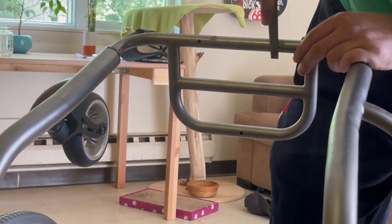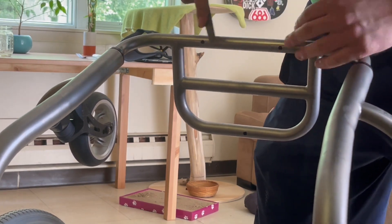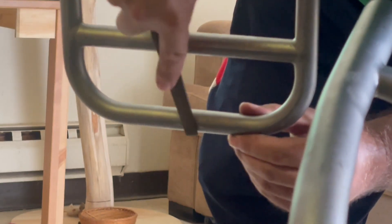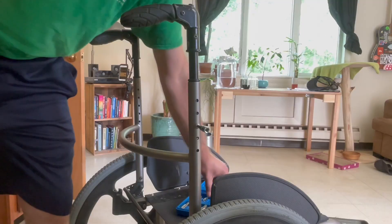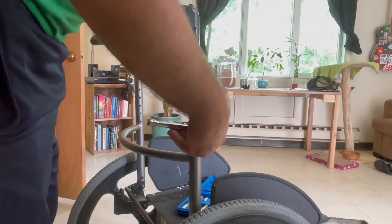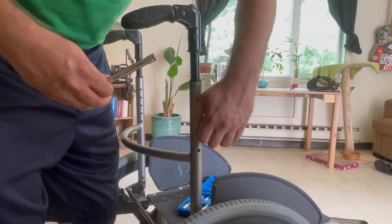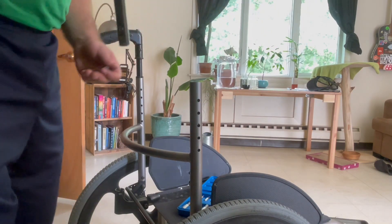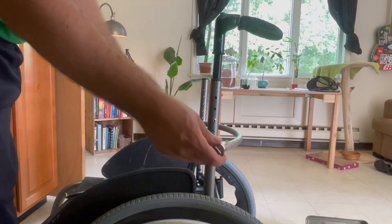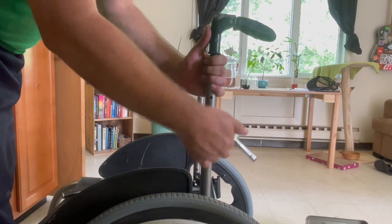You can see we filed all the holes there, and after that was all set, here we are removing the folding push handles. They need to be removed to install the new back I got for the chair. This was pretty simple — just an Allen head bolt that you pull out, one bolt and it comes right out as you can see. That insert that fell out needs to go in there to prevent play in the bar of the folding push handle. We went for the second one and these were really easy to take off.